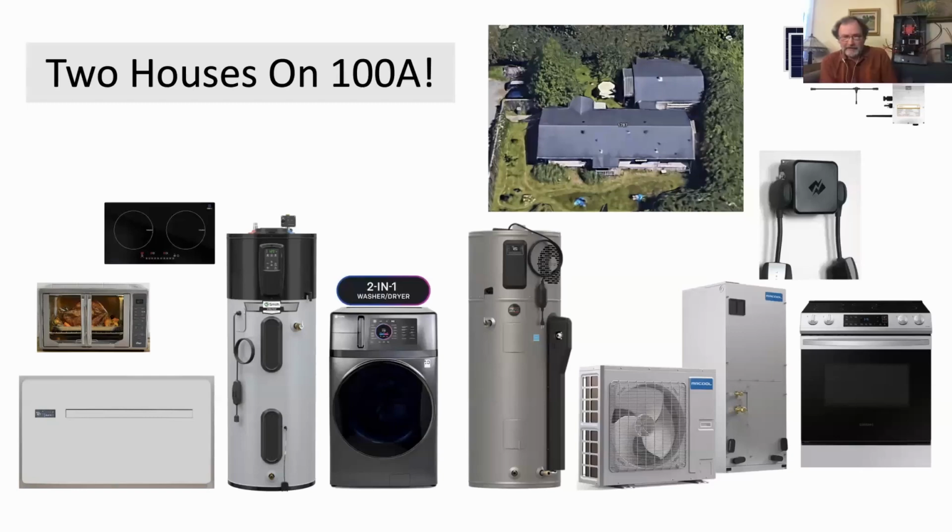Sean's cursor is on the far left, showing an Epoca unit, a packaged unit. That's the one. They do up to about 15,000 BTUs, so 1.3 tons per heat pump. You just plug them into the outlet on the wall. They can also come with ERVs if you add like $1,000 or $2,000 to them. It's not cheap, but ERVs come with them if you'd like. They can also have condensate evaporators so that the condensate doesn't have to be plumbed somewhere, but can just be blown out. So it's helpful for retrofits.